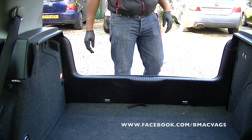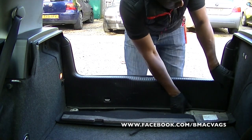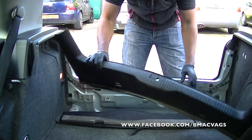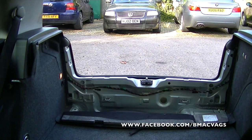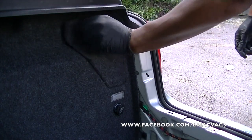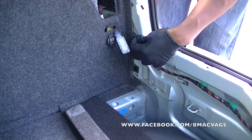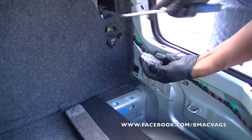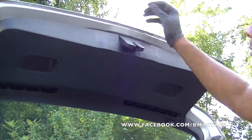Now we're onto the installation part. You're going to have to remove the back panel - just start by lifting up the edge of the carpet and pulling it out. It's only held on by clips, it's just a simple pull out. The side pulls in towards the centre of the car and the lower bit I'm holding there actually just pulls in towards the car. Once you've removed that back panel it all comes off pretty easily. Next, turn off the light by pushing the lock in with a screwdriver so the side light goes off - now there's no power to it. Undo the little port cavity there and push the side light through. You'll see the wiring there and it's pretty simple - it just moves to the other side and you can feel it. Just undo the clip, hold the clamps on the side and push it back through. Then we've got a little bit of wire to work with - I was going to go further down the loom but no need.